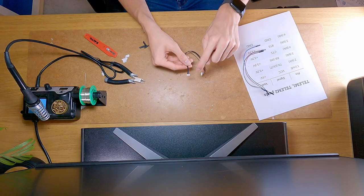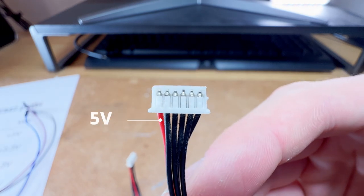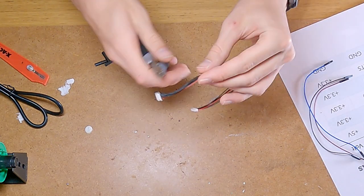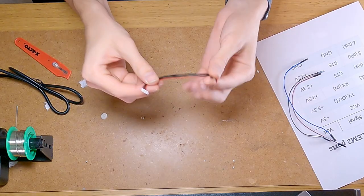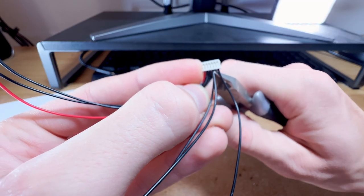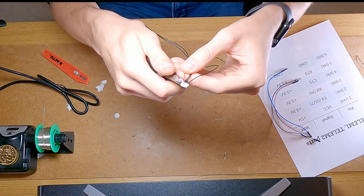Take your connector cable and orient it so that the red connector is on the left — this is your 5V wire. Wire number 2 is TX, wire number 3 is RX, and finally wire 6 is ground. Cut all 6 wires close to one plug. This longer section will be used as the main part of our serial cable. Trim wires 4 and 5 — these are not required.